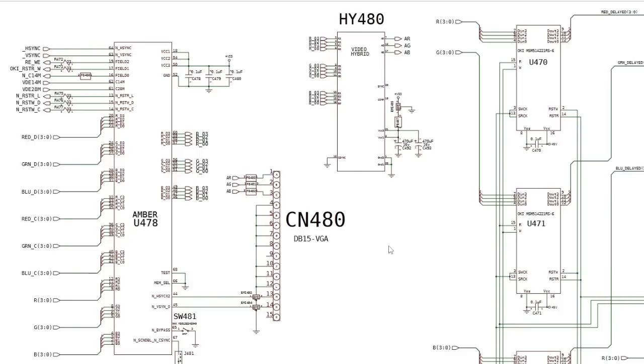and I would suggest if he was having problems with the socket, maybe he's got a missing connection somewhere like I had, because I had problems with the socket when I had missing connections to the 04. As soon as I dealt with those bad connections there, it was rock solid stable. Really, really crystal clear picture. As good as the AGA multifix.